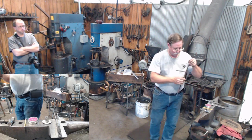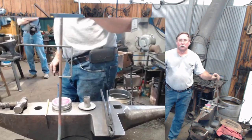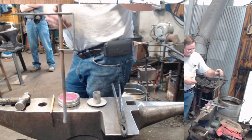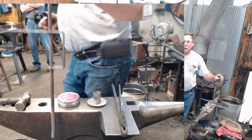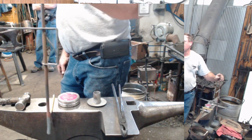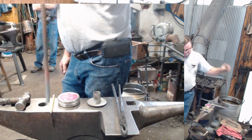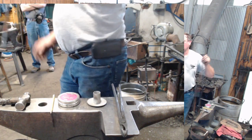And now, you've got your cage, you've got your upright, you've got your spring put in. Again, it's not necessary to use spring-type material. That spring was just made out of mild steel. If you just feel you have to do something with it, when you get it all drilled, heat it up and quench it. That'll add a little toughness to it. But that's going to hold about anything you want to.